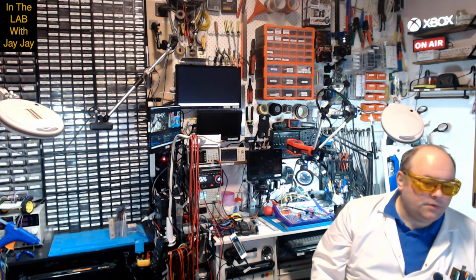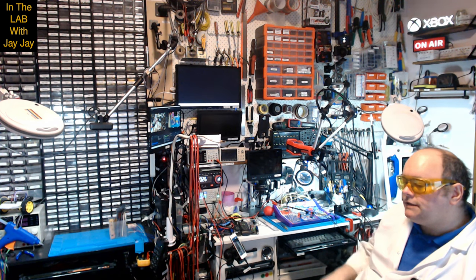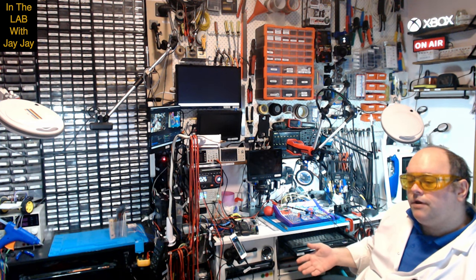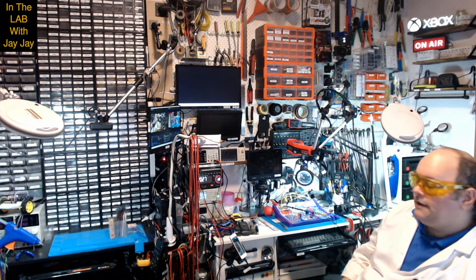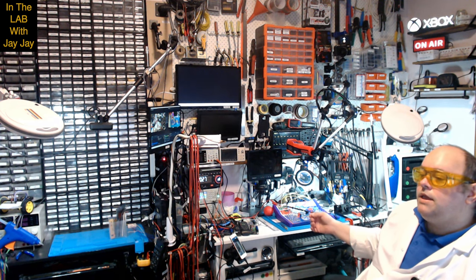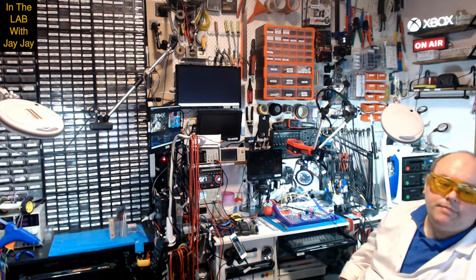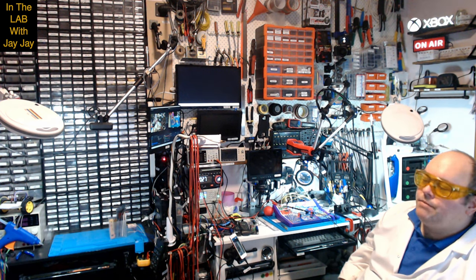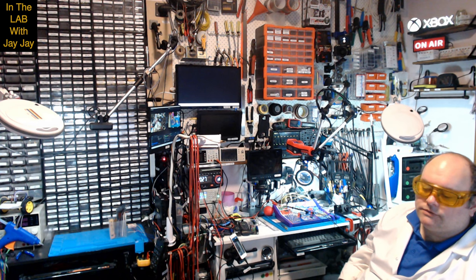And that's a wrap. So we put our circuit together. It was pretty easy to understand. It uses two transistors to turn an A-stable multivibrator signal on and off. It uses the amplifier to amplify the tone from the microphone. We messed around making the cable with banana plugs. I'm going to cut that out of this video so you won't see that. When we tapped on the microphone, that created enough noise for the circuit to engage and turn itself off. Voice alone didn't seem to be loud enough, and I mean, I don't want to start yelling at the thing. I spoke fairly forcefully into it. It didn't seem to work, but tapping it did work. So yeah, that's the basic idea. Trying to give you some experience with amplification and some experience with transistor switching. So that's what that was all about today.